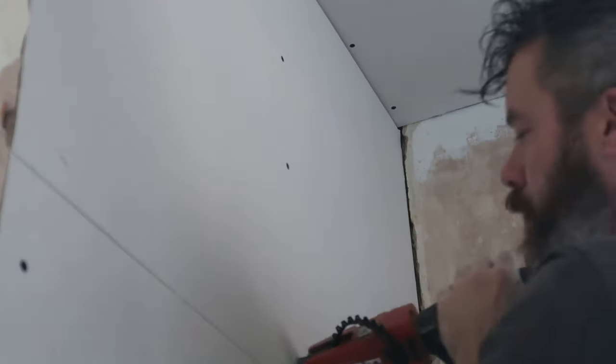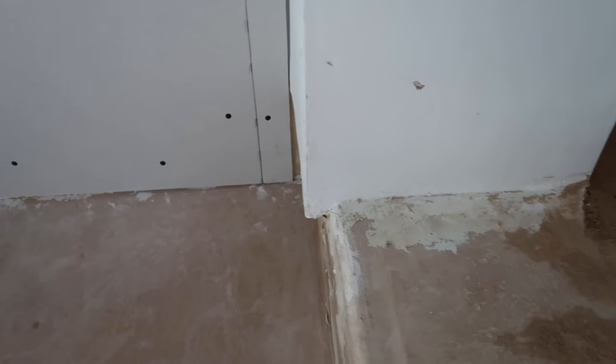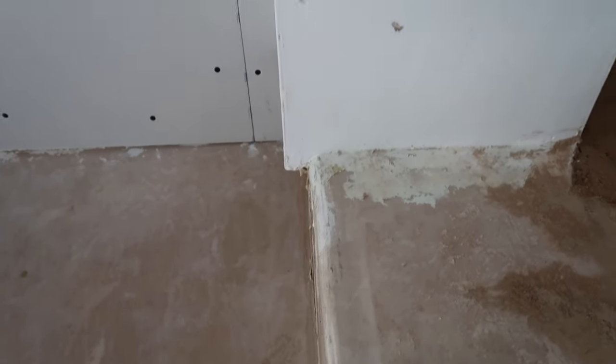Next day. Now, I want to get off as quick as possible today. It's the Friday before Christmas, so I spent a few hours tacking these two ceilings. This part I'm in must have been an extension or an add-on at some point. A little bit behind me there, I've got some boards cut ready to bring out this bulkhead so it all meets up in line. There's about 15 mil difference, so I'm going to sort that out.